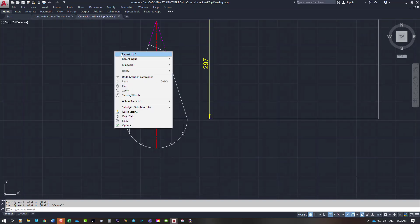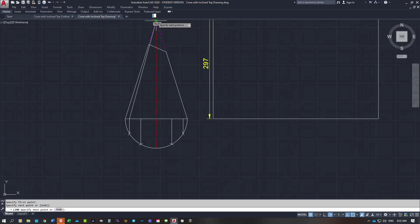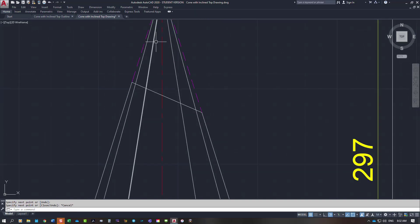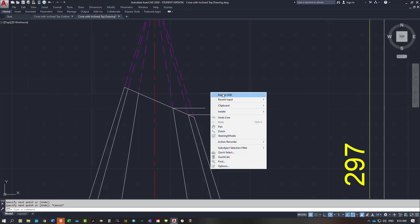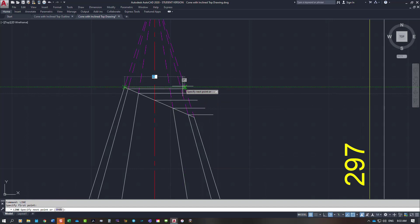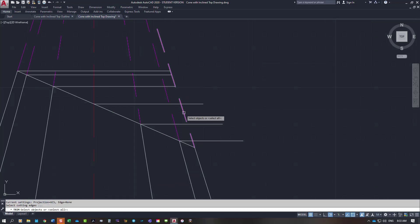From those points I draw lines vertically up to the baseline, then all the way through to the apex — same on the other side. I break all these lines and they become projection lines. To start marking out the pattern, I draw lines horizontally across. The outside edge line is already true length; the other lines need to go across horizontally to that edge. Those are all projection lines at this stage.